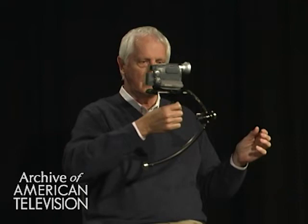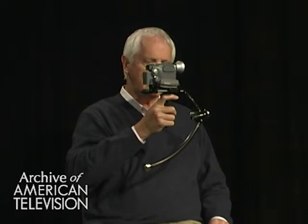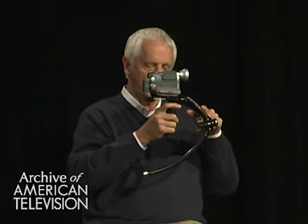And the missing piece that makes up the Steadicam patent is, there are four things. First, spread the mass out. Two, hold it with a gimbal. Three, provide a suspension so that your own arm doesn't have to lift it, because in the case of a film camera, it's too damn heavy, right? And then finally, give yourself a way to see the image. In the most primitive sense now, camcorders come with that. They've got a screen. So that fell right into our hands, I must say.